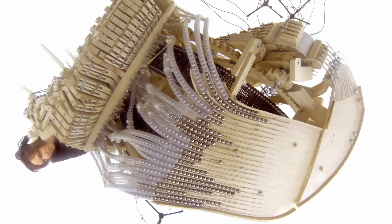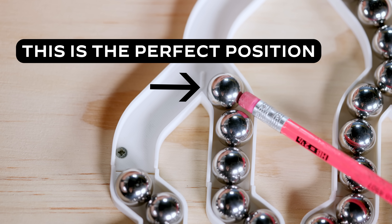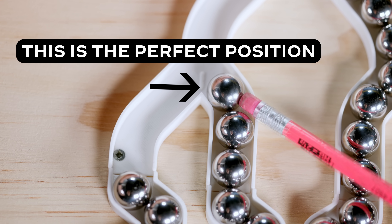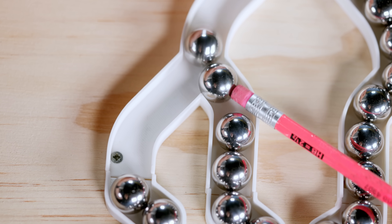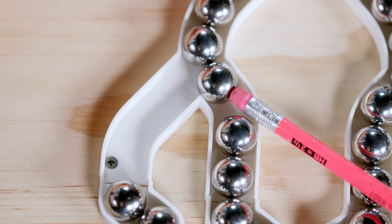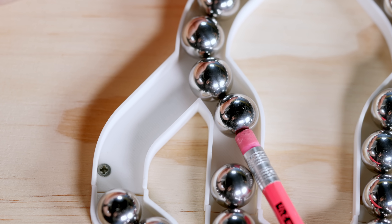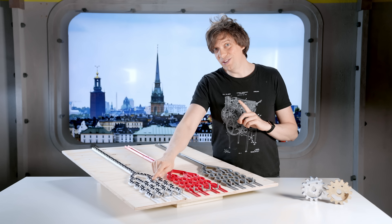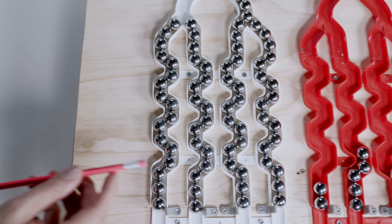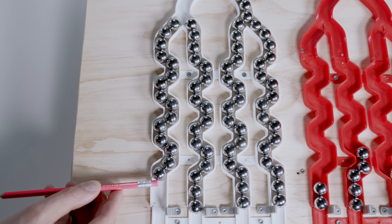This is important for a musical marble machine, but for these crossroads to work properly, the marble here needs to be positioned at the perfect position. If it's too high, the incoming marble won't have space to fill the empty channel. And if it's too low, the next marble gets stuck and no other marbles can come through. That's where these wiggly tracks come in — their geometry creates a super cool rubber band effect on the marble queue.